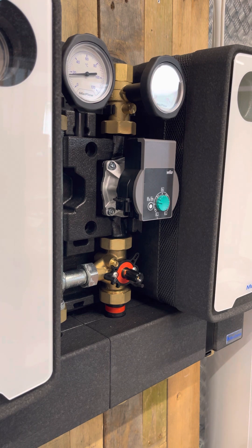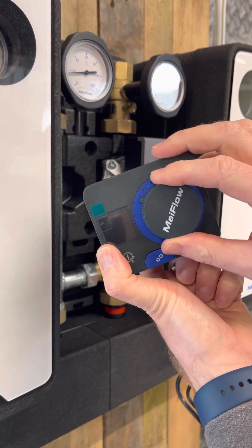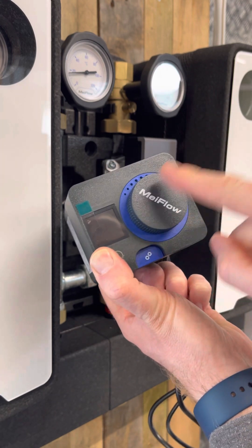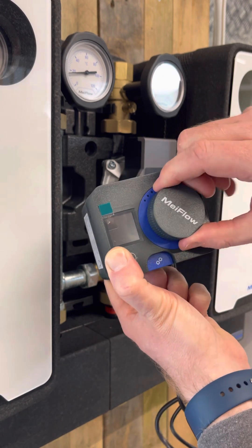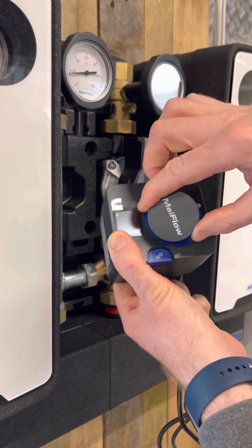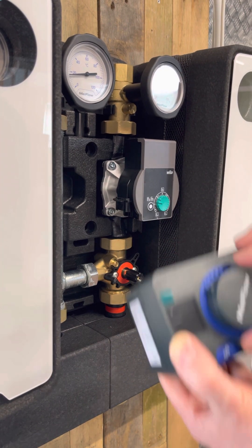This is the mixing valve actuator. You've got a manual override button here - you can't rotate the knob on the front until you put it in manual mode. Once in manual mode you can rotate it a full 90 degrees of travel. On the top there's a little lug that should go from minimum to maximum as you turn it. Make sure the front piece is on correctly so it rotates from minimum to maximum. This down position is the minimum position.